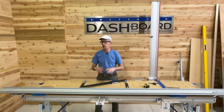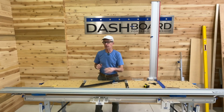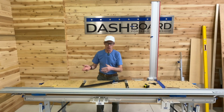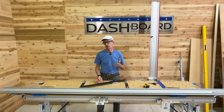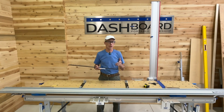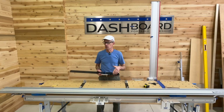Okay, so just to review, I bought 3 boards that were 11 feet long. Each of them was a different width. So I've cut them into 3 sections because I need 3 distinct pieces for this desktop. I cut a straight line on each one of the boards. Now, I've also jointed that original straight edge just because I wanted to make sure it was as square as possible to each face, because in the original rip, they weren't necessarily square since each piece was a little bit warped. Now I have that one straight square clean edge, and I have set the parallel guides with the rip gauge to the minimum width, or a little bit less, of each of those 3 boards. So now I'm going to rip them all to a uniform width, and then I'll be able to glue up the 3 sections.